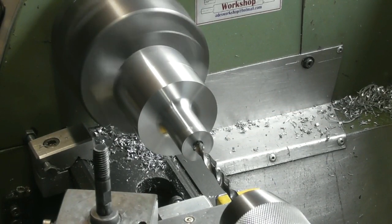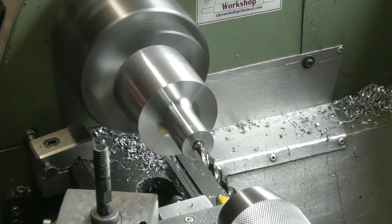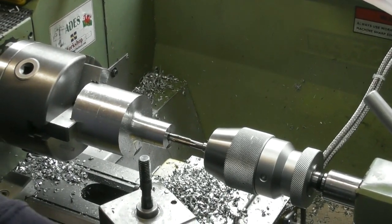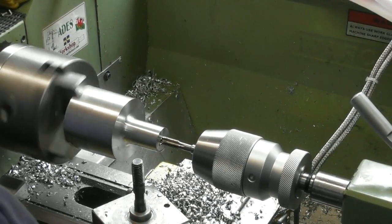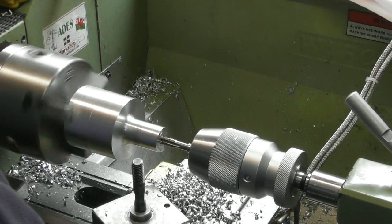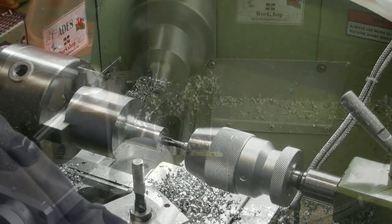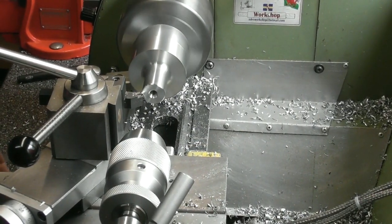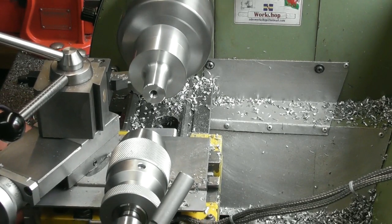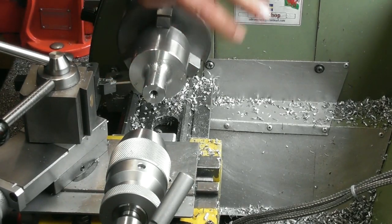My next plan is to stick a 6.8mm drill in — just ready to accept an M8 tap. I sprayed it with WD-40 and got my winding handle in. I'll put a quick 45-degree chamfer and break that edge on the top for now, even though I'm going to machine something on there afterwards.